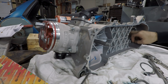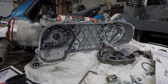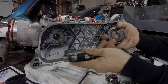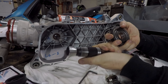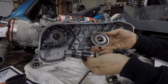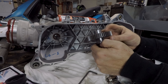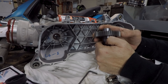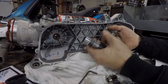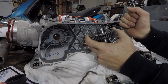Going to install the axle and bearings. This is the shaft I'm using for the wheel set. I need to install the new gear onto it - it is a heavy press fit, you'll need a press, I have a 12 ton. Heating up the ring gear to expand it a little bit makes the press fit a little easier, so let's do that.